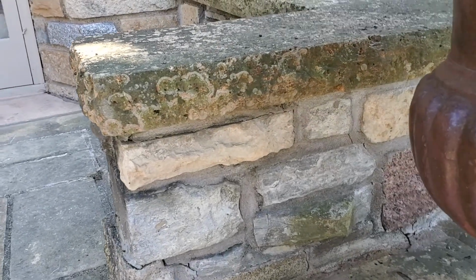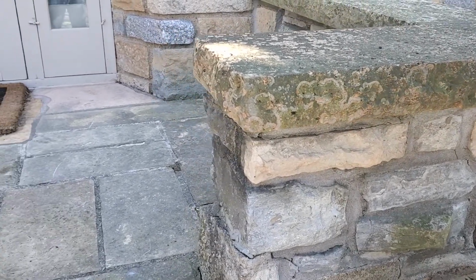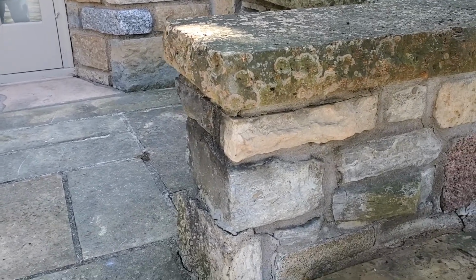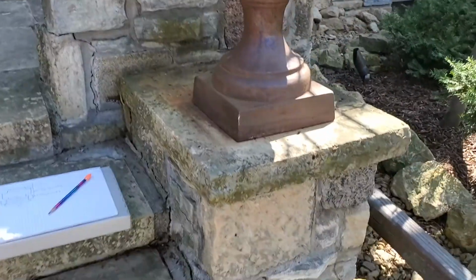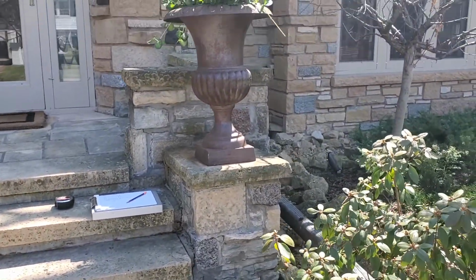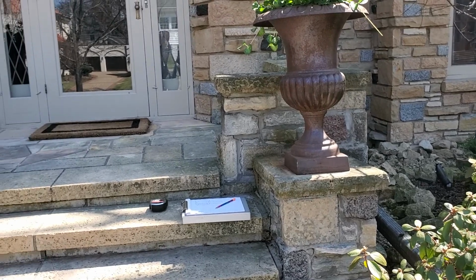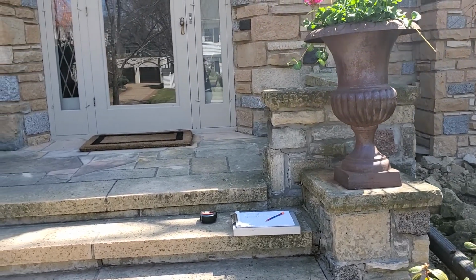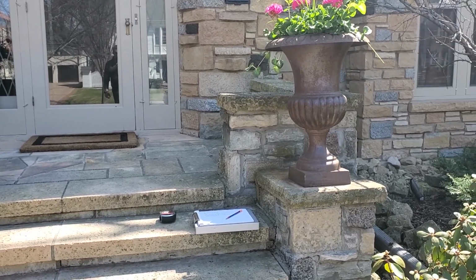So the buttresses, like I said, they wanted in the same footprint. So we're going to need to get some 12-inch veneer, or cut some 12-inch veneer or wall stone to make this. Obviously the treads can be whatever they want, but I told them 2 3/8 to the 2 1/4 inch, the standard thickness of caps. So we're not going to do 3-inch caps, we're going to do the 2 1/4 inch caps.